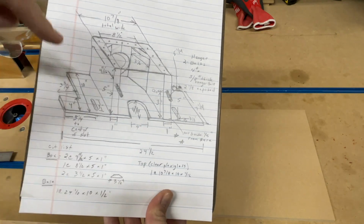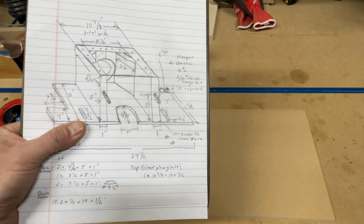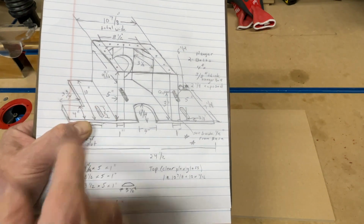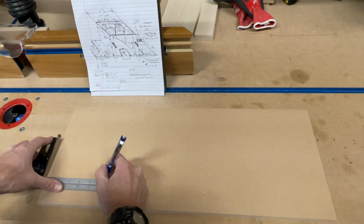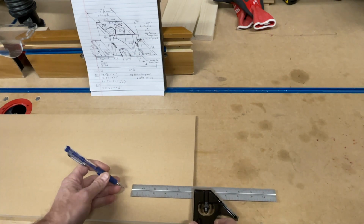Do it this way and then mark on the shaper where these slots are so that you can put a perfectly placed hole there. Now, remember, these are going to be 1/2 inch wide slots, so they're a little bit bigger than the actual bolts. 5 1/4. The reason I'm doing this before the notches is that when I shape this, it's going to be much easier to shape this piece with the slots already in them than afterwards. So you want to go ahead and put the slots in first.